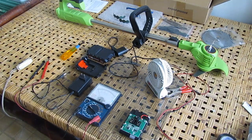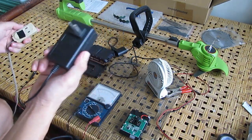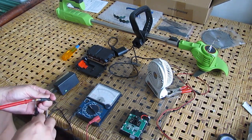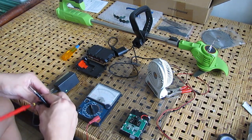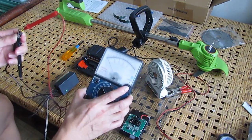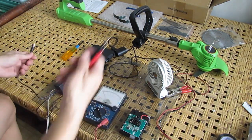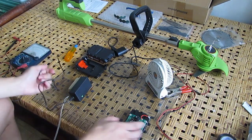I'm going to check our charger to see how much voltage it outputs. Plugging in and checking — it's over 10 volts. Setting to 50 volts range — I'm guessing this is around 20 to 21 volts. Yes, as you can see it's around 20 volts. So our charger is working and we need to fix the battery pack which is just so deeply discharged.